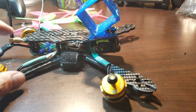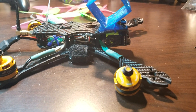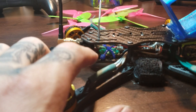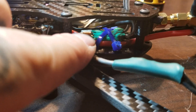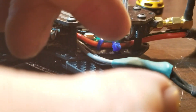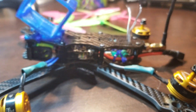These are pretty badass — I think they're four-mil arms. That receiver is not going anywhere: double-sided tape and then cross-stitched zip tied. I melted the face on the zip ties so there are no sharp edges. I wanted the power wires and the ground wire to go around the receiver and not constantly push on the plug, stressing it out. So when I re-soldered them I had them go out and around, then zip tied — came back out nice and clean.